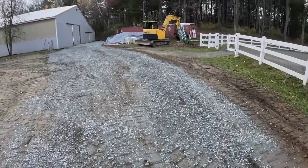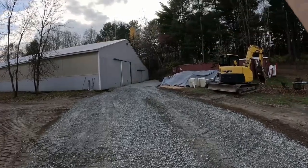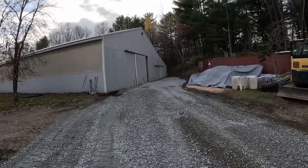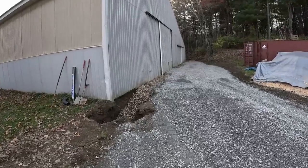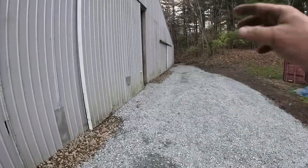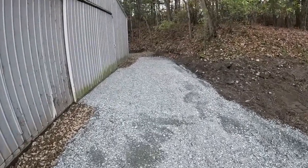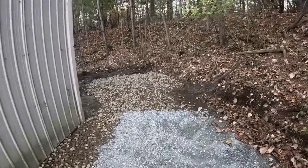This pole barn is completely flat around and everything is up so high over here. I created a ditch swale with about two inches of pitch to get any snow melt or water into our trenches and out of here. This trench is three foot wide, 26 inches deep at this point. Number three stone, fabric over it. We put double layer fabric because we had crusher run so that doesn't mix down in there. The mats will go on top of the horse wash bay - anything coming off that 10-foot wall, snow and all, goes into this circle pipe.